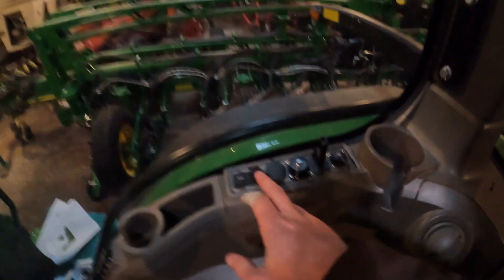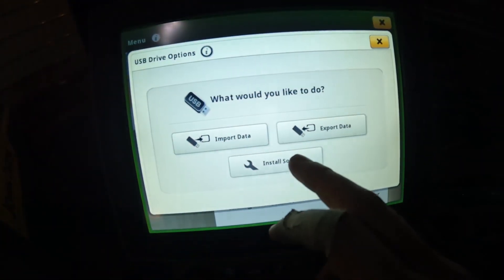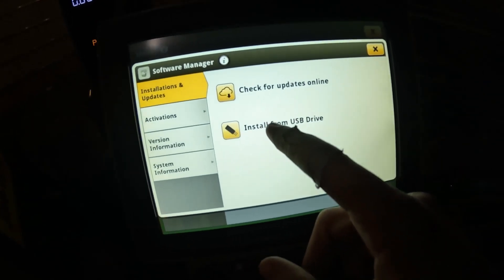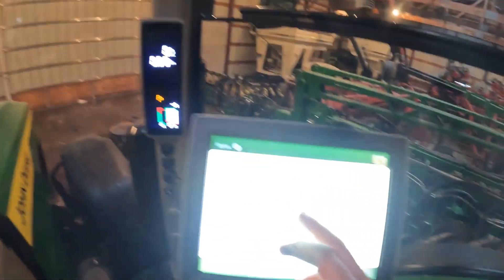Every season - every spring and every fall - John Deere comes out with some kind of iOS-style updates for the tractor, so I just got to plug in the thumb drive here and make some quick updates. These usually have some relation to GPS, AutoTrac, turn automation, or something related to the app. I'm gonna update this 8R 340 and then head to the back of the shed and update the 9620. The trick to installing the software update: there are actually two USB drives - started with the first one and nothing came up on screen, but plugging into the second one brought it right up. Then just tap 'Install Software' and 'Install from USB Drive.'